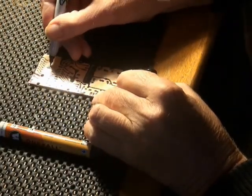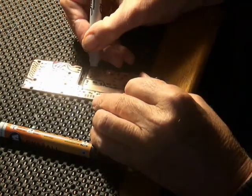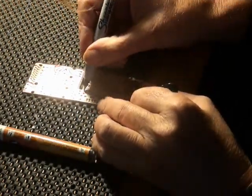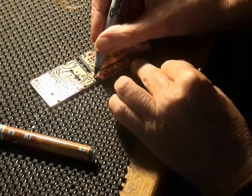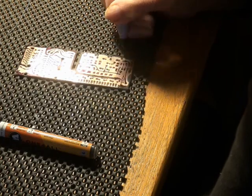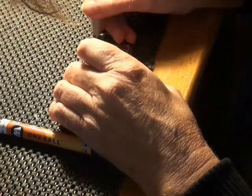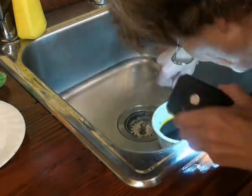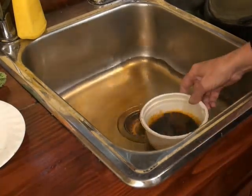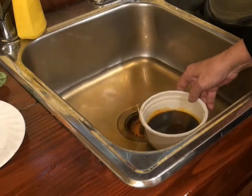Now it's time to draw in some traces. I've become lazy with routing over the years as good quality fine wire does about the same job, but I will attempt to reduce the use of said wire as much as possible, as long as it's not taking more than an hour to do so. I use Staedtler or Sharpie super fine tip pens, or laundry pens, and more recently fine tipped acrylic pens for pads. By habit, I will fill open areas of copper usually with test pads or ground plane. This is to reduce the use of ferric chloride etchant, which I will reuse over and over. I see videos of people dumping it after one use — how environmentally wasteful of them. I have found that I can make 15 to 20 boards of this size with only one cup of the etchant. It's very quick if the etchant is warmed up. This ferric chloride had only been used once before, so it took less than a minute.